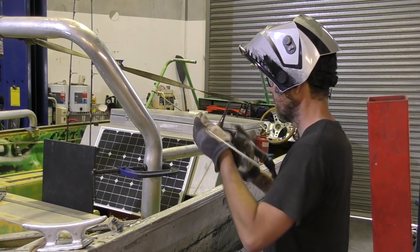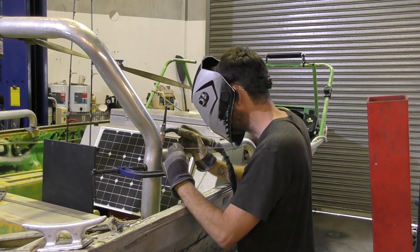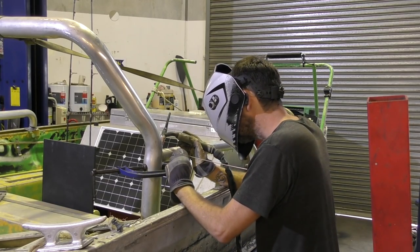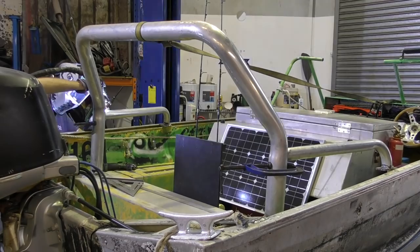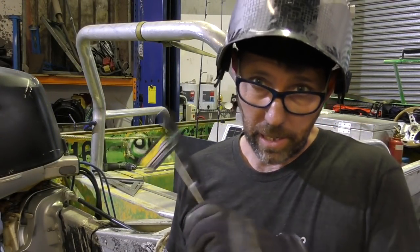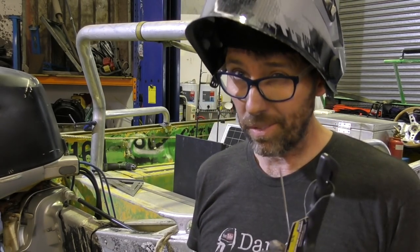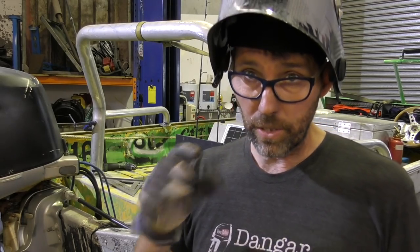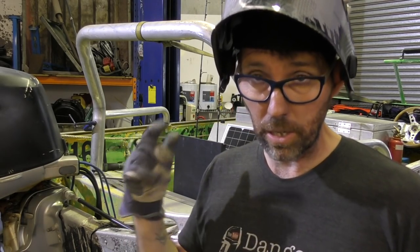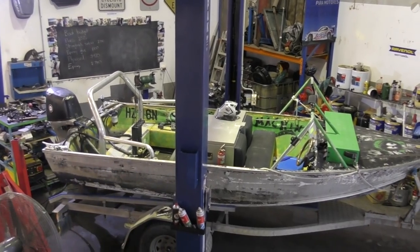I'm just doing a little bit each side so I don't get too much heat and distort anything, although I have been turning the amps up because it's quite thick aluminium and it's taking quite a bit — also because it's got that hard oxide layer. I'm going to do a video just on aluminium welding soon because the green machine's got a crack I need to fix. I'm no expert, but I'll definitely do a bit on what I do know. What I really like about this bar is it gives the green machine a bit of a distinctive touch that stops it looking like every other boat.